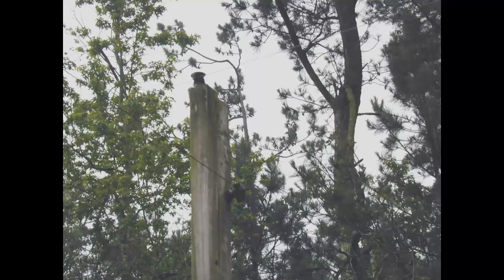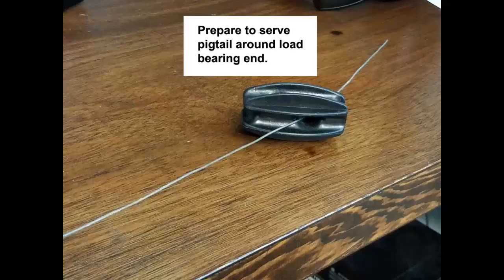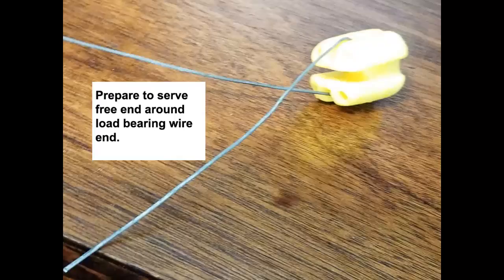The end insulators of the antenna are particularly important because they're really what has the bulk of the tension. So the antenna itself should float through all the support insulators along the length of the antenna and only be tensioned from the very ends. And so the best thing to do is to use a conventional serving wrap on the end insulators, and use the strain insulators or compression insulators the way they're designed to be used, so that the wire goes through the hole and lays over most of the body of the insulator instead of coming off the short side. You don't want the two holes to pull each other apart. You want the two holes to be in compression and be trying to push the insulator together.